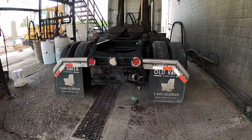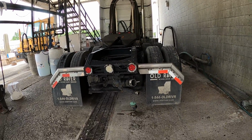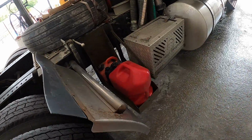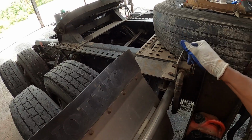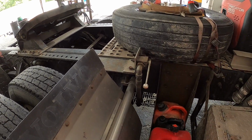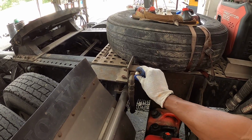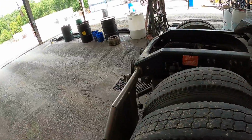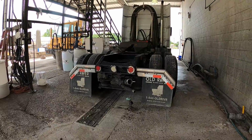So I'm gonna go up front and charge my pumping system. Now over here, it's gonna be loud, so I'm gonna explain it. What I like about my system is I can control my pump through a throttling system. A lot of pumps, as soon as you turn it on, it jumps into boom, which tears up a lot of pumps. But this one here, I can manually control the speed of my pump. Okay, so we're gonna crank it up and go ahead and rinse that and do a quick wash, and we'll be out of here.